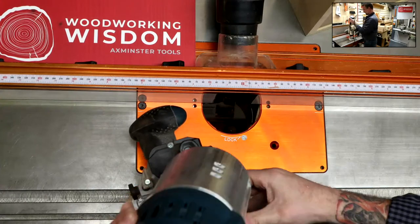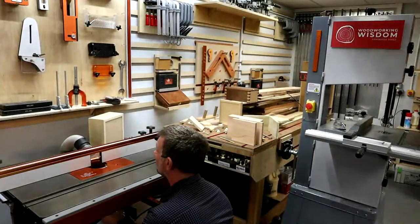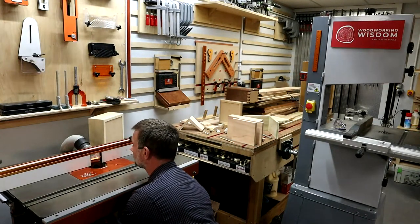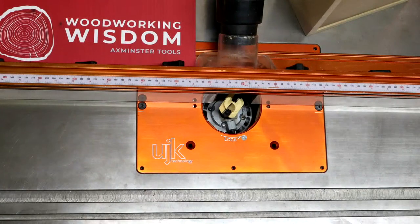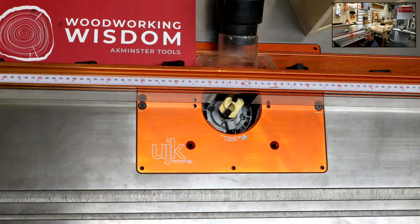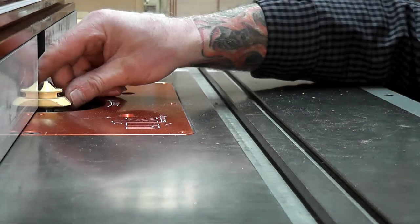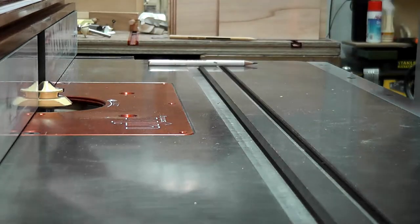I can come out of there now and be loaded straight in under me, into my router table there. There we go. All right. And you can see that cutter there. So if you can go to camera 3, Jace. There we go. We can just see the cutter coming through. It's not locked off because we're a bit wobbly. But what I need to do now, I need to get that bit of wood back. And I need to find center. I need to align my centers.